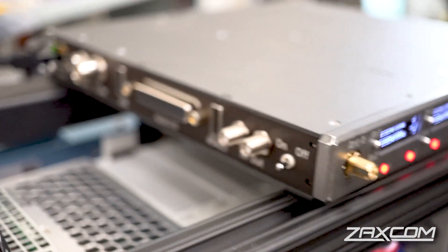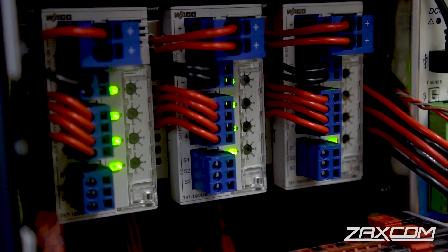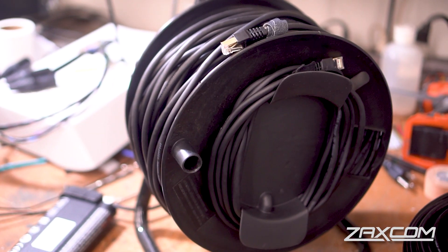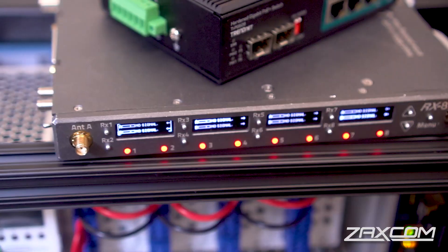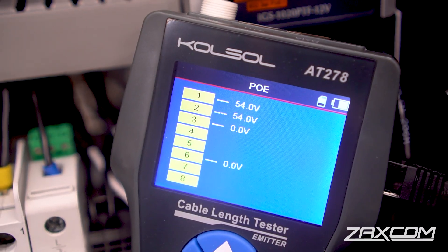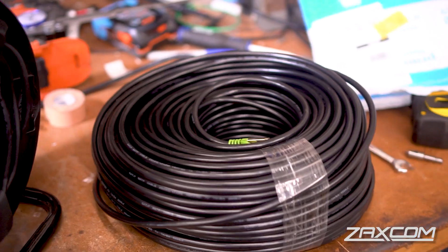The RX8 has two powering options: it can either be powered over HiRose or over Ethernet. We did quite a few distance tests — we tried five feet, ten, twenty-five, and worked our way up to find where I would consider signal reliability to be bulletproof. That turned out to be 250 feet over a single Cat 6 cable coming off a TRENDnet TI-PG62B switch, which is capable of taking 12V input and stepping up to the full PoE standard of 56V. Powered externally, we achieved 300 feet over Cat 7.